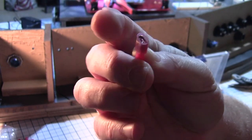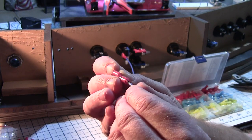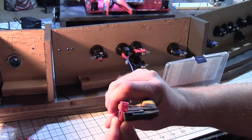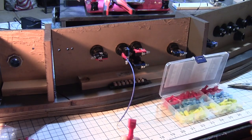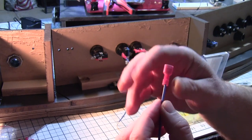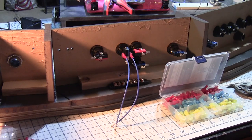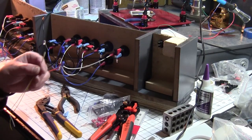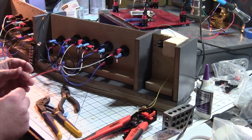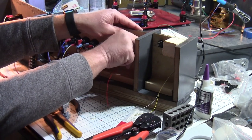Now, rather than solder all the wires together, I purchased some connectors that I could crimp to the wire and slide onto the positive and negative side of each button. I did decide to use a few regular LEDs in strategic places along the panels. These are pre-wired with the resistor, which saves a ton of time.